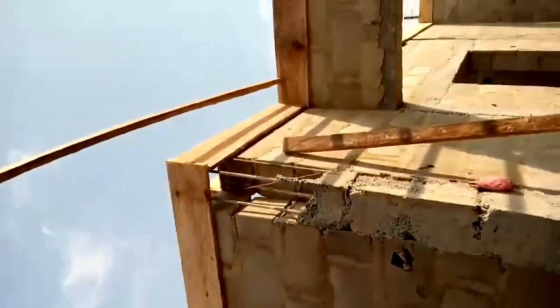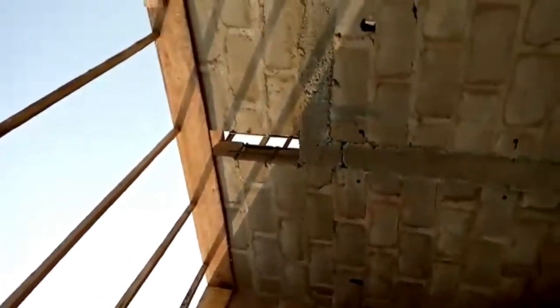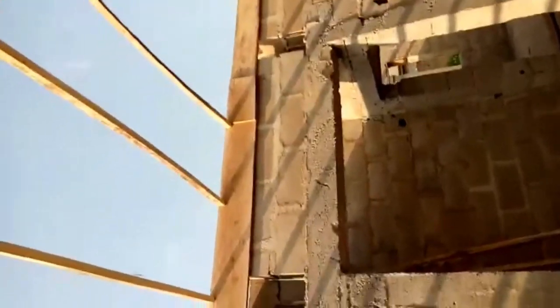that should have been done. That's a lesson. As soon as you start your foundation, your plumber, your site engineer should know every point where toilets and bathroom will be. So these pipes must go in right from the beginning so that you won't have to be cracking anywhere on the wall. Okay, so that is exactly what we are talking about at Ebony World TV.